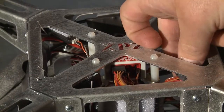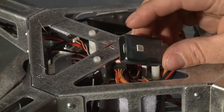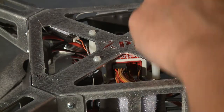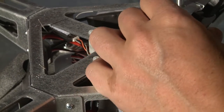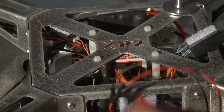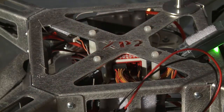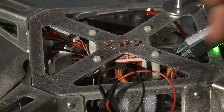First thing, we need to take this little guy out here — this is the DJI NAZA. This is the thing that has the little light on it. We're going to take the cord that comes with the software and plug this unit in — it's just Velcroed right underneath here. You want to make sure you have your props off, your radio is on, and this is plugged in. Then we're going to go ahead and plug in the battery connection. You'll hear some ticking maybe — that's why you want your props off, because if these motors decide to spin up, you could get cut and be in a lot of hurt. So go ahead and get the software going.